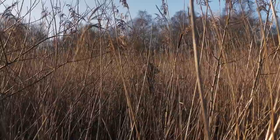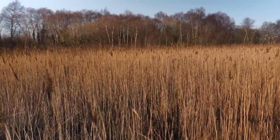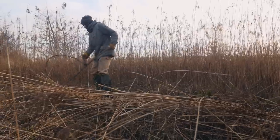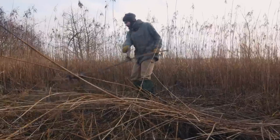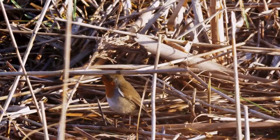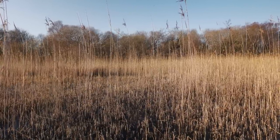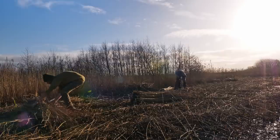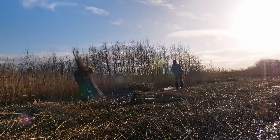The beginning of January, water reed is finally ready for harvest. This is one of the two key materials we chose to cover the medieval roundhouse roof with. These annual water reed shoots have died. Their stems are now dry and the leaves from last summer have just been shed. It is important the reed doesn't have its leaves anymore as they enhance rot once the reed is applied to the roof.